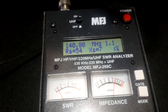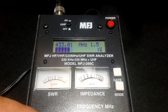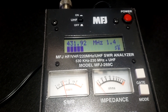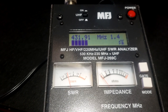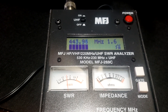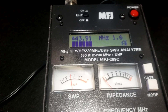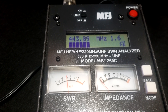So I need to shorten up the antenna on two meters quite a bit. Now in the 400 megahertz area, it's resonant right about 430 megahertz, so that needs to be shortened up as well — the antenna is too tall. Let's see what it's at on 440. At 444 it's 1.6 SWR, so it's actually usable. It's usable on two meters as well, it's just higher than I would prefer.